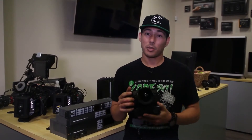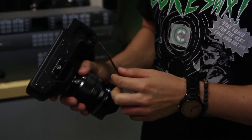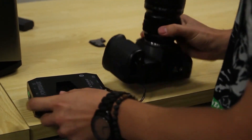We offer a series of cables with different battery forms, so in this case the LP-E6 style is the one you need. The Pocket 4K has a detachable battery door that you unclip to insert the dummy battery cable. Plug the other end of the cable into the 8.4-volt DC jack of the battery, and then mount to the camera.